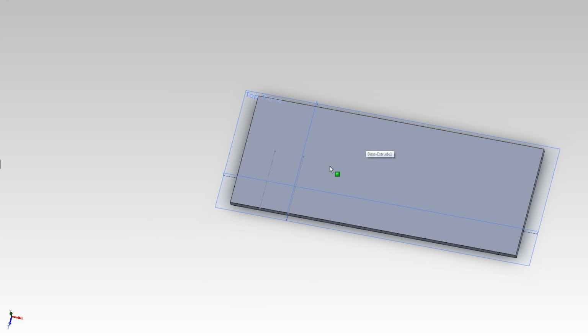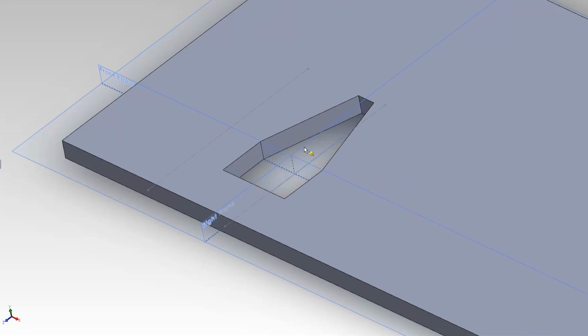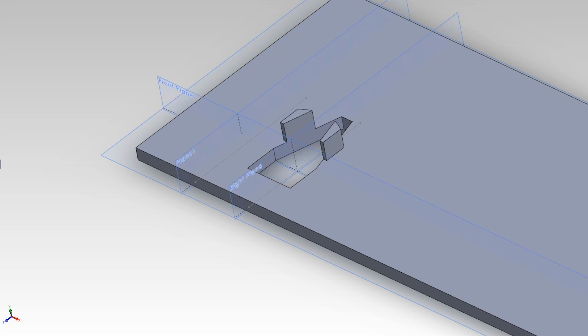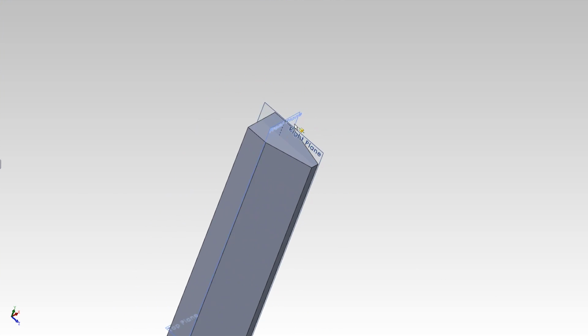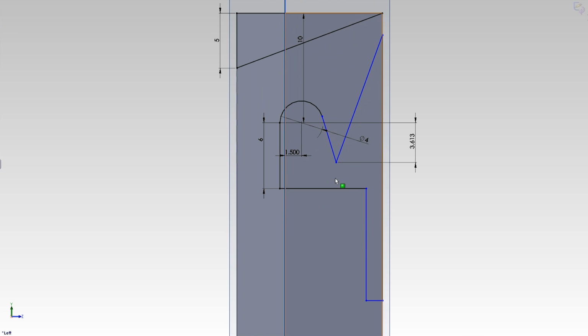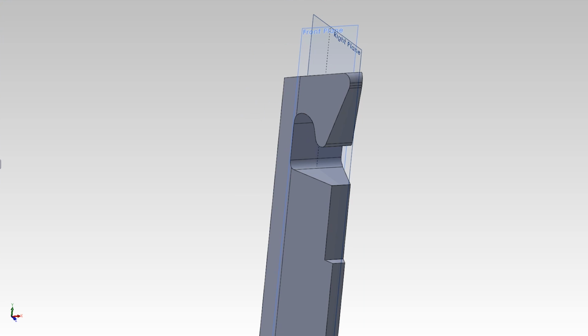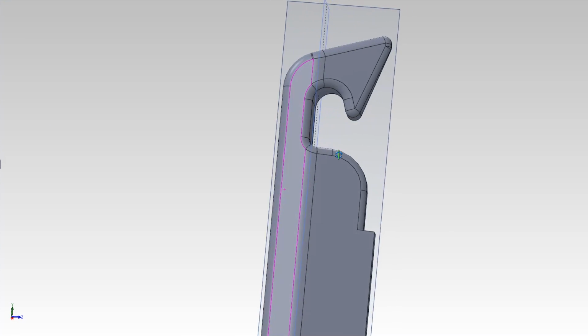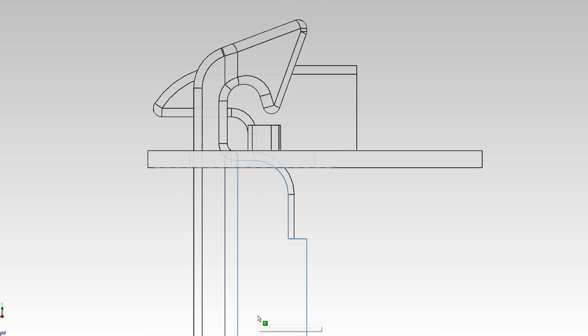Looking at videos and images of these machines, I started by setting the half pitch distance between two needles. I made a hole for the needle and also 2 prongs and a hole down section, and then some fillets to make it all neat. I started the needle with this section to fit in the hole, as well as a few different features that looked important. And then I looked at the design from various angles to make sure it made sense.